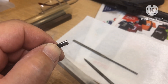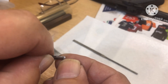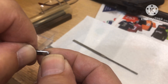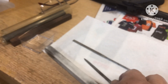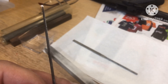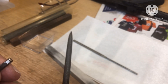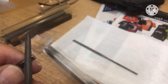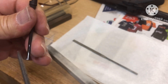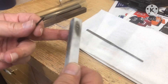That is with a few passes. I can't get rid of the scratches — they're laid into that thing — and I don't want to remove all that material, but since it's carrying up the same direction it's not going to be a big deal. I found a burr in the corner because they used a sharp-edge file when they did it, and you don't want that — it'll collect dirt and it also left a burr. So I've got to take that burr off and round it over, give it a few swipes on the 45 edge and get rid of that burr.